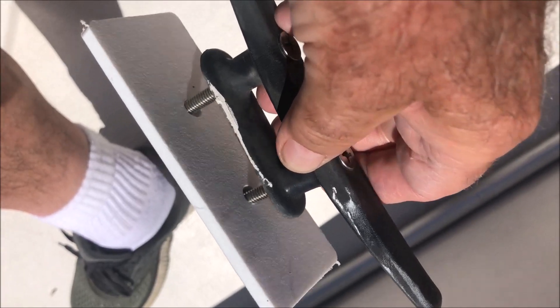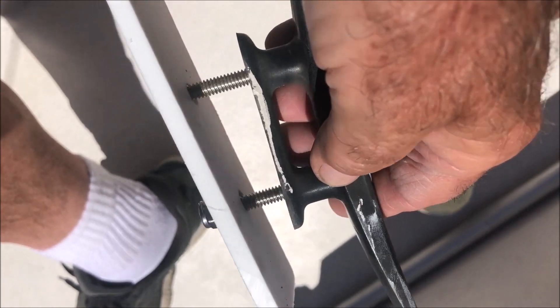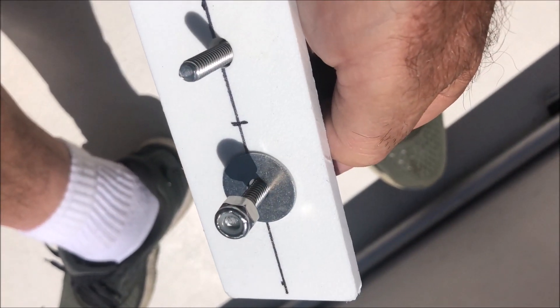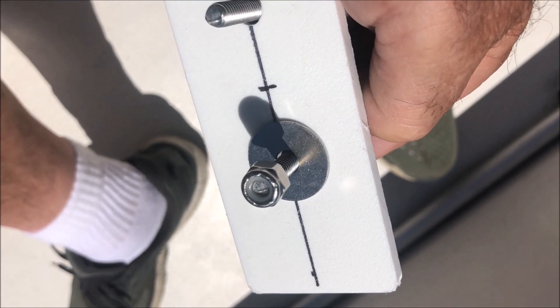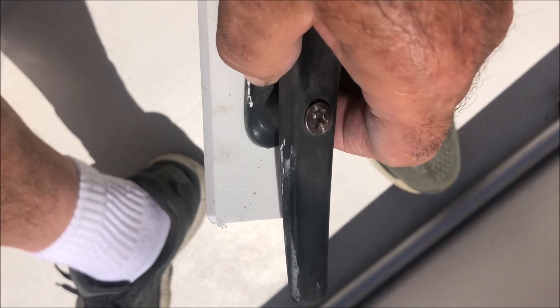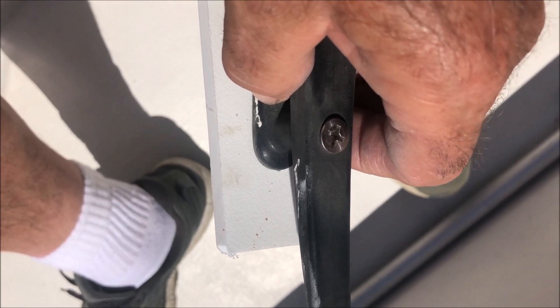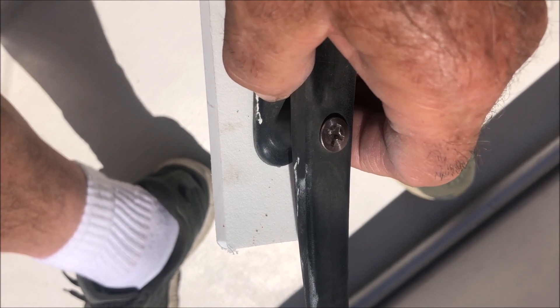This will be the new backing plate. It will spread the load over a much wider area. It's made out of starboard. It will come through to a fender washer and a lock nut. I intend to glue the top side of this to the bottom — I use 4200. That should be a much sturdier install than the old little tiny washers.